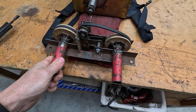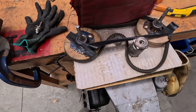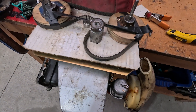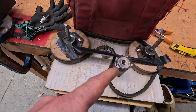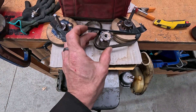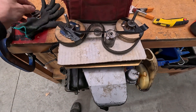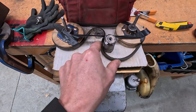It looks like it should work but it needs a better go of it. There's a ladder belt here. Now this idler pulley or belt tensioner should really be on the other side because this spins that direction — you kind of want it to be pulling straight off a pulley. The reason for this little zigzag part is to get as much bite onto this little drive pulley because it's so small, I need more bite on it. It might just need a slightly larger idler wheel there. But first thing, I'm going to get a plate to replace that cardboard.